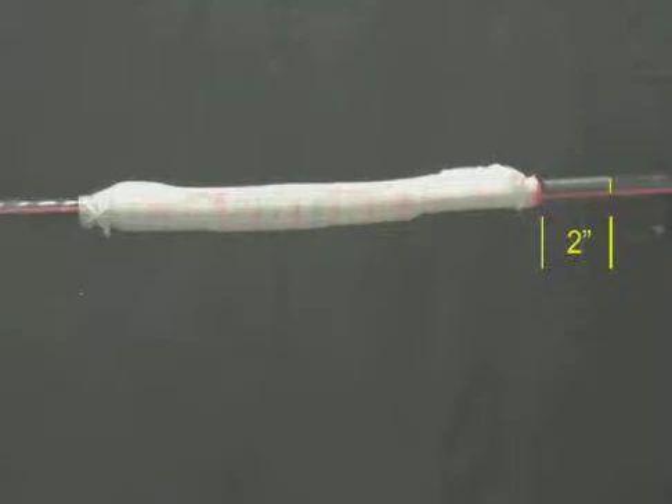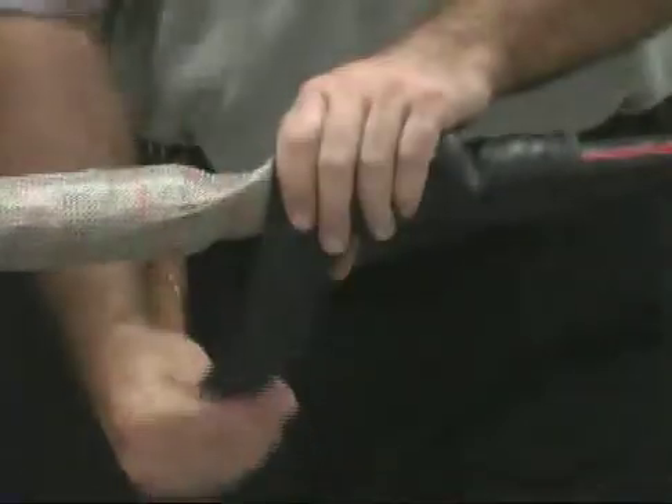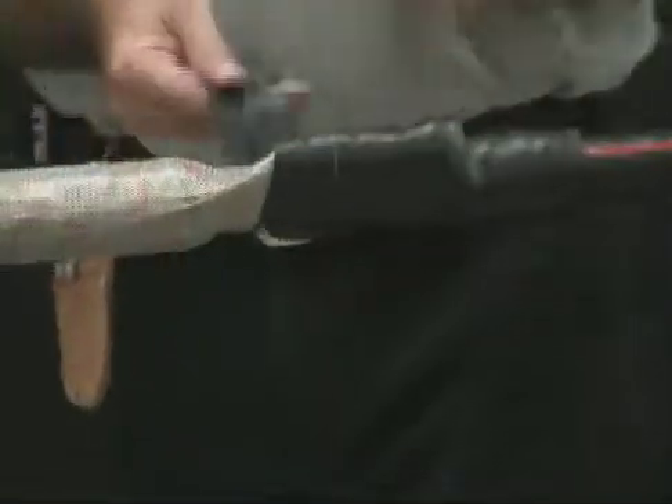Make another mark at 2 inches from the end of the copper mesh. Peel back a short length of the release paper and make one full wrap, then work to the right using half-laps, pulling with moderate tension to ensure a good bond between the mastic and the tape. Make sure the mastic is on the left edge of the re-jacketing tape.